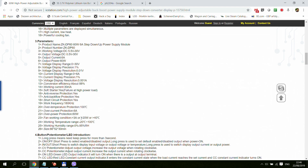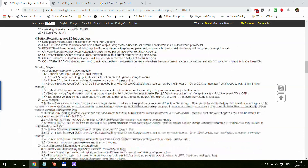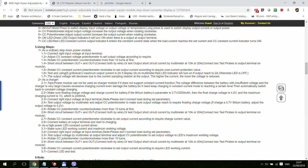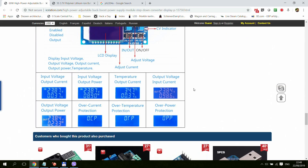As you can see, the fan turns on if the unit consumes more than 20 watts or goes above 40°C — that hasn't happened for me yet, but it probably will at some point. There are descriptions of how the different buttons work and how you adjust the different modes. You can also see how to use this module as a charger — for example setting a constant rate, or how it references 3.7 volts or 4.2 volts for charging a LiPo. But honestly I just want to use it as a general power supply where it's easy to adjust the voltage and current limit using the two pots without going into menus.